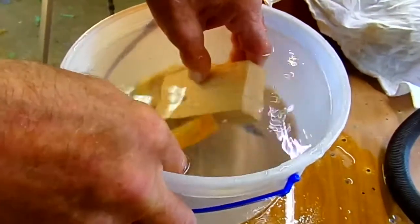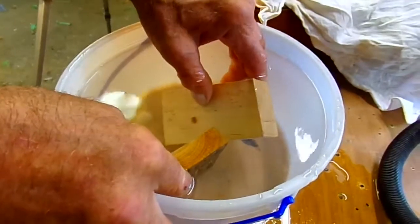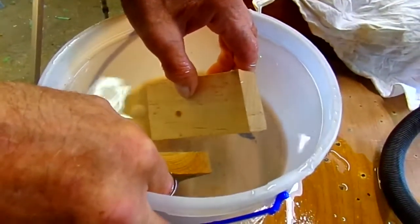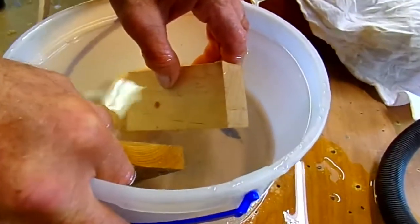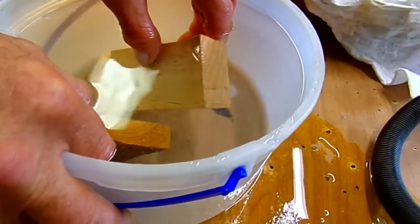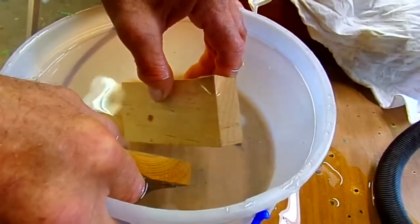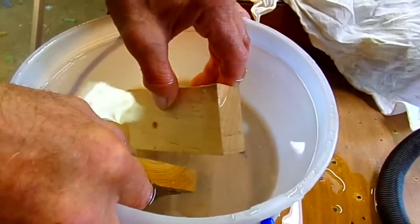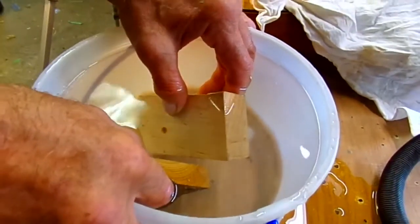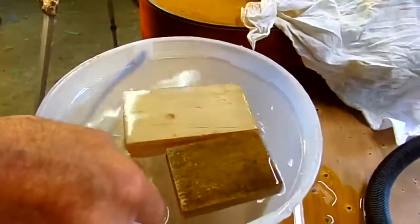Probably with more force. Anyways, it will continue to do so. See the little bubbles there, foaming, until the wood reaches that temperature. And then it happens real slow. You can see the bubbles coming out of it there. And the glue cools off, and you end up with a bad or a faulty bond, compromised by cold wood gassing off. There we have it.